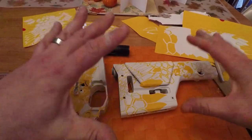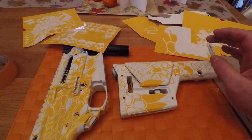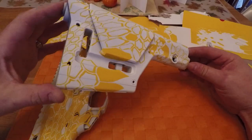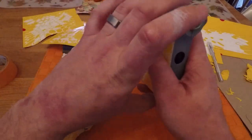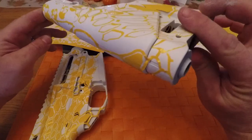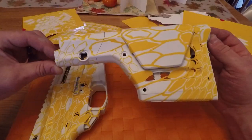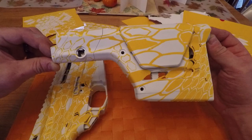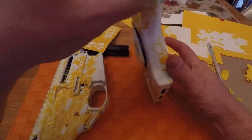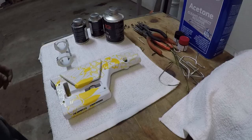Let's get back out to the garage and spray this bad boy up. I'm going to leave the stencils on for the baking process because this Magpul — remember I talked in the first video — Magpul had no idea what temperatures and time limits this polymer could hold up with. I did 10 minutes in, 10 minutes out, 10 minutes in, 10 minutes out, 10 minutes in, at 350 degrees, and I got no melting at all. That's really good to know if you start doing this Magpul polymer gun coating. 350 degrees is okay, at least on this PRS Gen 3 buttstock.